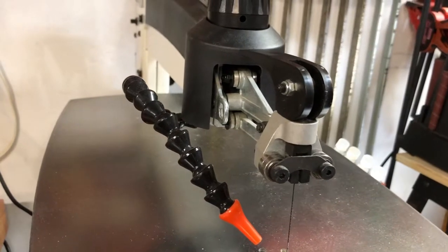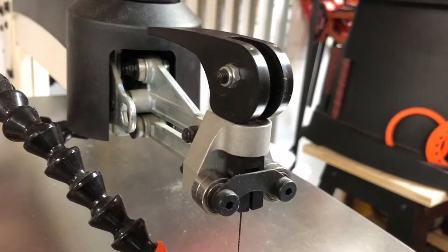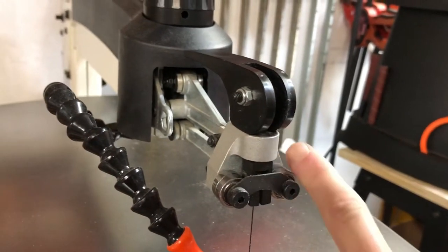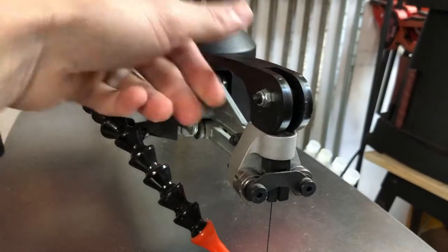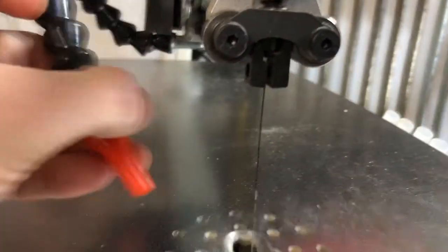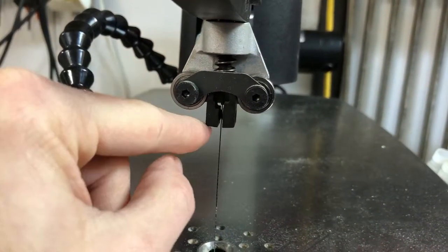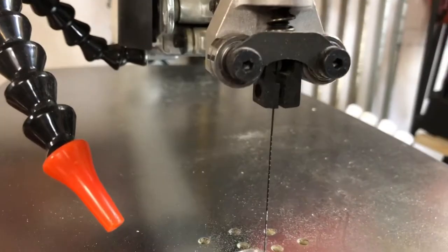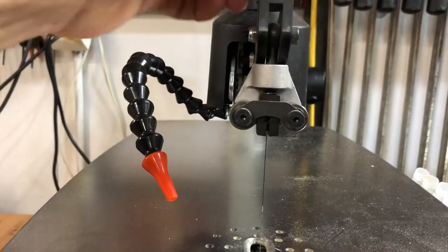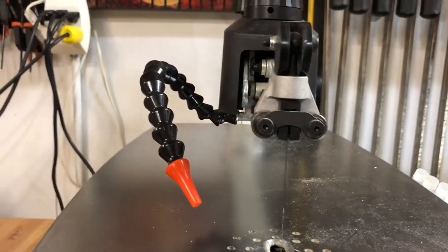One thing that is uniquely interesting with the JET saw is the upper and lower clamping mechanism. With your typical scroll saw you would have a knob to tighten the blade and then your top lever would flip to put tension on it. JET has designed something to do this all in one stroke. There's a space where your blade flips right in, with two little adjustable pins on either side to set centering and tightness. You just flip it up and it tightens your blade.